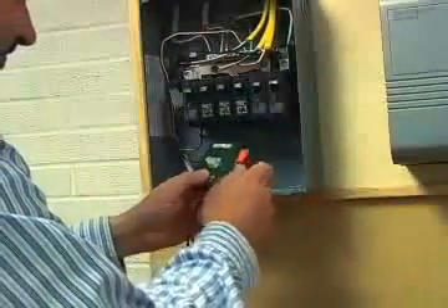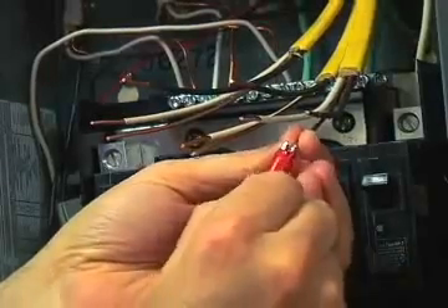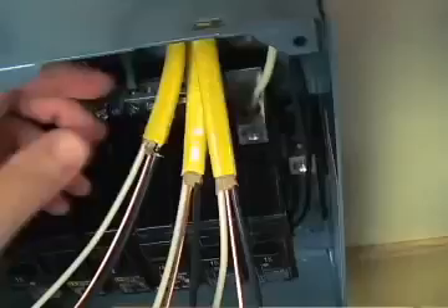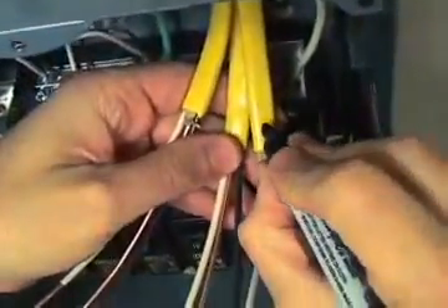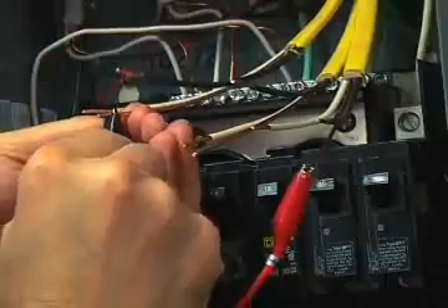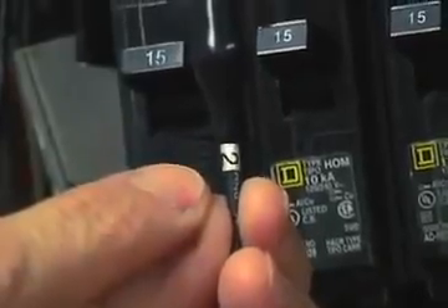The polarity feature can be used to identify multiple cables. We will use three Romex cables to demonstrate this feature. We will connect the red test lead to the ground wire in the first cable — notice that the red lead has a wire marker labeled number 1, so we will label this cable number 1. We will then connect the black lead to the ground wire in the second cable, which is labeled number 2.